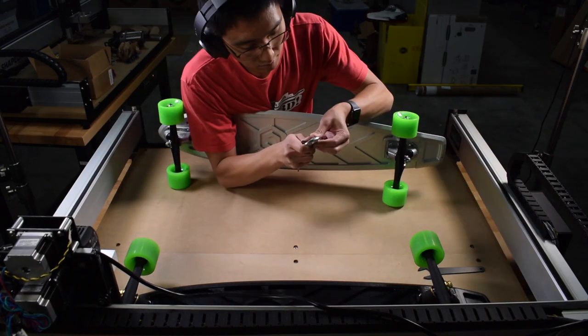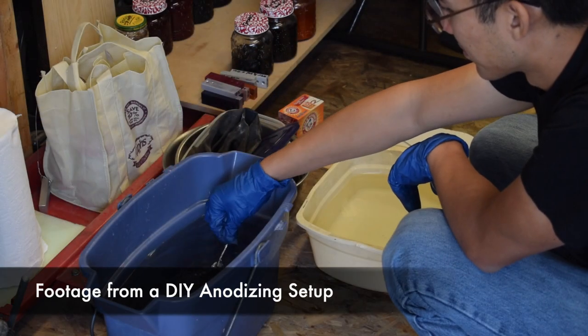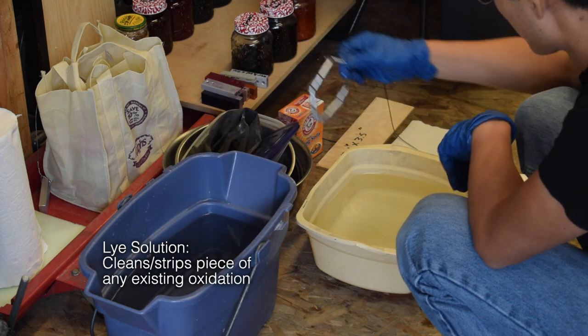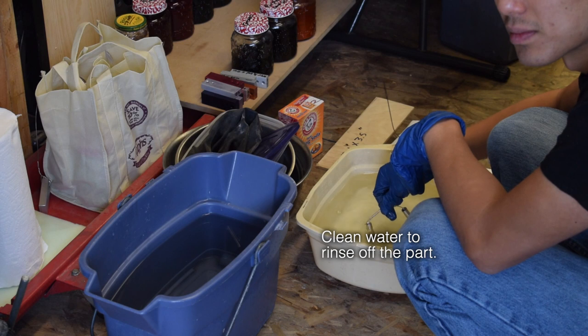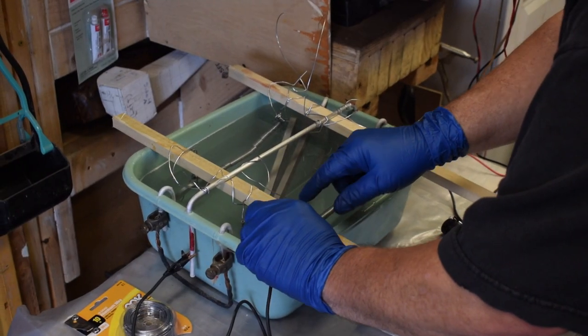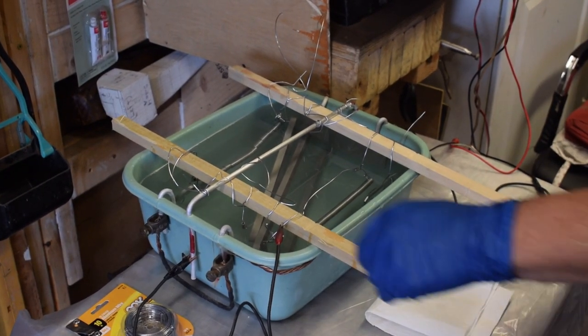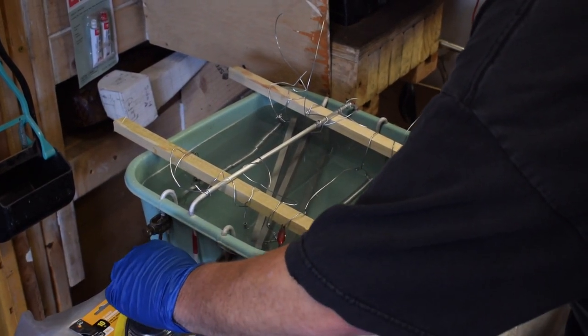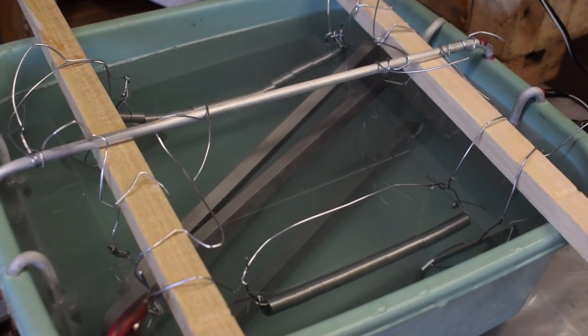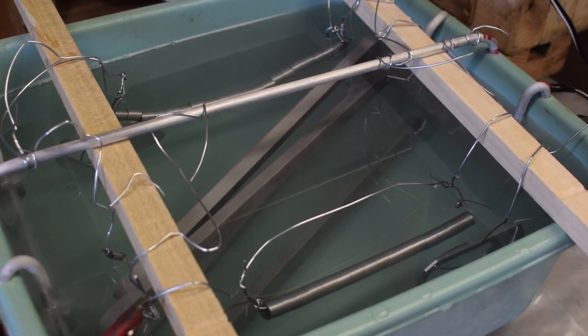For those curious about how the anodizing process went, here's a quick summary. Anodizing is the process of growing a layer of aluminum oxide on raw aluminum. Unlike rust on ferrous metals, oxidized aluminum forms a barrier that stops further damage to the underlying material. If you can form an unnaturally thick and consistent layer of aluminum oxide, that layer can serve a protective function. To do this, you first soak a part in sodium hydroxide to dissolve away any existing oxidation. Next, you submerge your cleaned parts in sulfuric acid while attached to electrodes — as current flows through the parts, it induces the growth of aluminum oxide. Once a solid layer has formed, which you can identify because the surface will no longer be conductive, clean off your parts with distilled water and seal the porosity of the oxide layer by boiling your part. Optionally, you can include a dip in a liquid dye that will get trapped in the structure of the oxide layer.